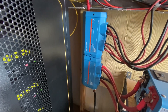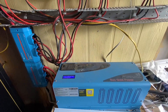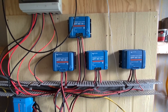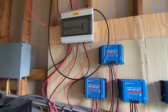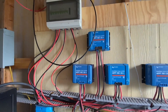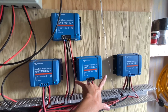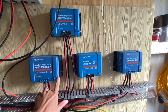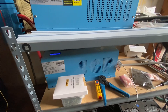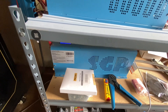So this is a quick tour of our solar setup. Those are our bus bars, we have our power inverters, and there are four charge controllers on the wall. There are solar panel breakers and the high voltage panel box on the wall in the corner. Two of the charge controllers are running 1260 watt panel sets and the other two are running 1000 watt panel sets. Down here we have our Sun Gold power inverters — one is running the cabin and the top one is running the RV.